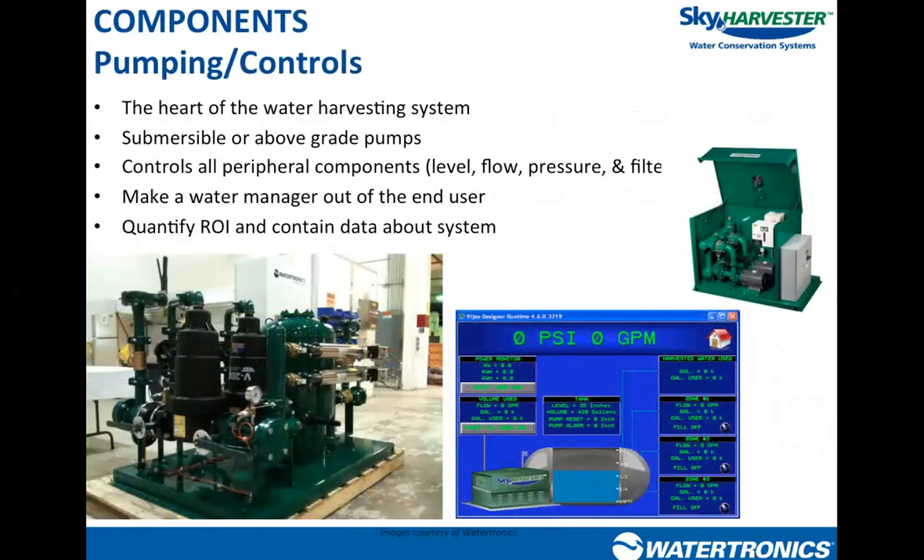That's a brief view of webinar one. Now we get into the mechanical portion, starting with the pump station — the heart of the rainwater system and the first component that gives the user a window into what's going on. Unlike tanks and pre-filters that have no electricity or moving parts, the pump station tells you flow and pressure, tank level, and coordinates ancillary equipment including filtration, treatment, disinfection, level controls, alternate water supply, and alarms. If you want to monitor remotely via a building automation system, it will most likely connect here as well.